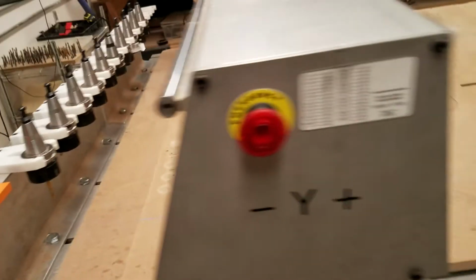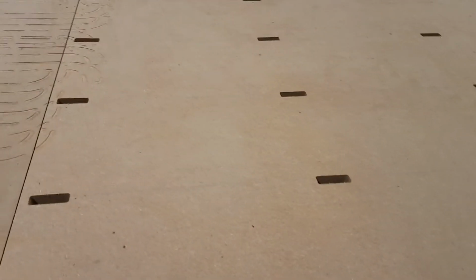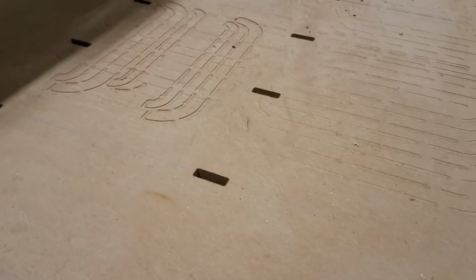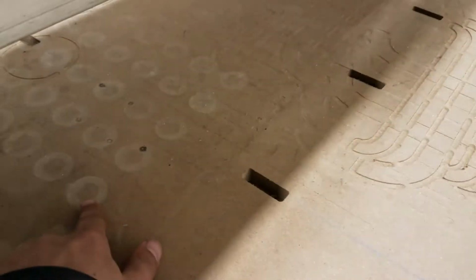We're just going to quickly go over the anatomy of this tool so we're all on the same page about what it's called. This is the spoil board. So it will get spoiled with time, and then we can do another surface pass to smooth it, to bring it thinner and thinner until it needs to be replaced. However, it is really important that we try to not cut into the table. So these cuts are way too deep. This is what we're aiming for. I can't even feel it.